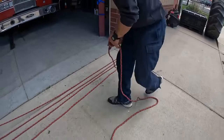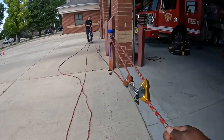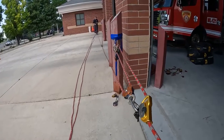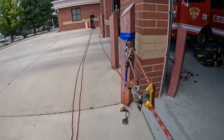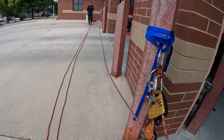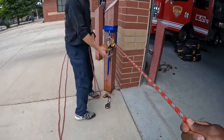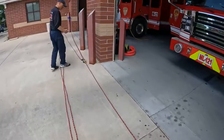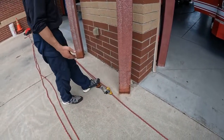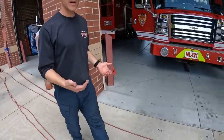Let's see what happens when I pull. So we 2-blocked — this collapsed. I had more than enough. So in reality, my 39 feet is actually right here, not all the way back there — that was just guesstimating. So this is an inline compound system, or staggered inline compound system — 3-on-3 to make a total of 9.